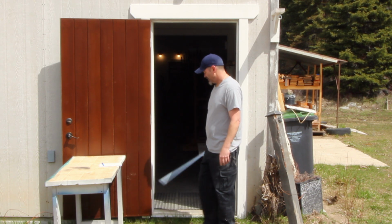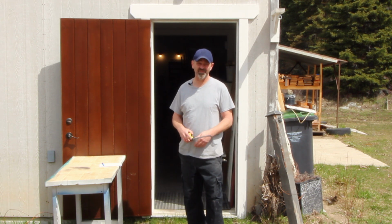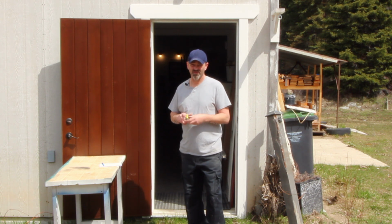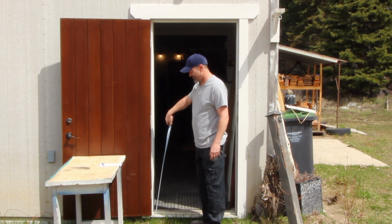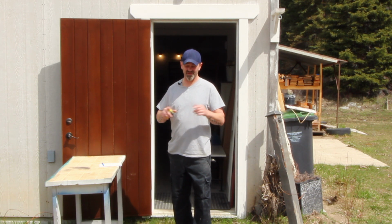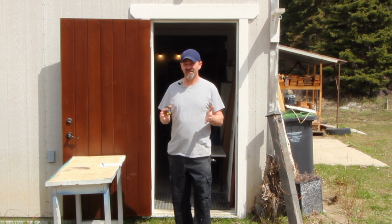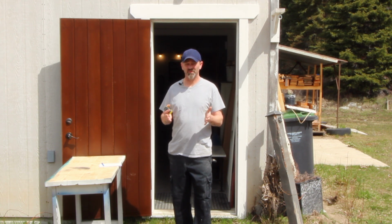Height-wise, what you'll want to consider a lot of times is that the bottom plate on a jamb is sloped. So when you measure on your inside, you want to be as close as you can to the jamb or the frame itself. It is sloped a little bit. With thicker doors, it's more of a factor because it can be cut on a bit of an angle, but you'll typically want at least 1/4 inch, and 3/8 is better, on your height. So those are just a few things to consider when you're looking at replacing a door.